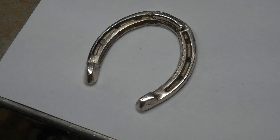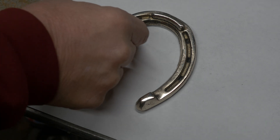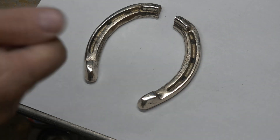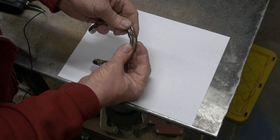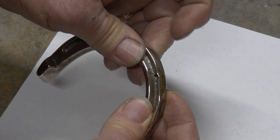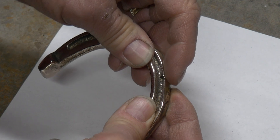So there it is. I kind of started polishing it — and there's a reason I'm not holding it. Boom. Yeah, it just broke. I was polishing it and it fell out of my hands, hit my leg, then hit the ground. You remember when this thing was coming out of the sand? I pointed out a little hole right here. That is what's known as hot spot shrinkage.